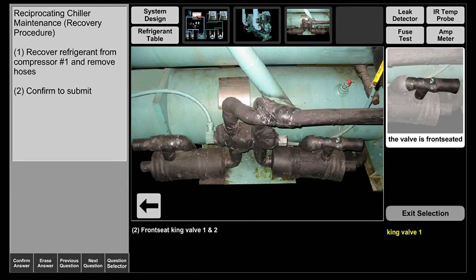Ultimately this stops the flow of refrigerant into the evaporator, causing a drop in pressure in the evaporator and the refrigeration circuit. The machines are going to turn off on a low pressure cutout, which is a safety cutout.